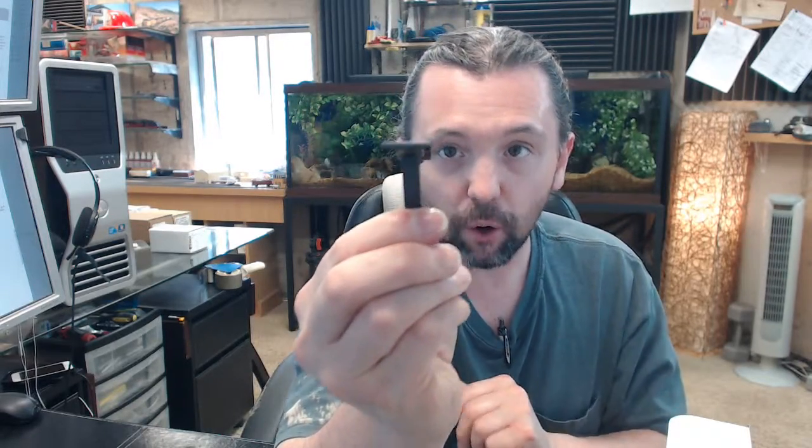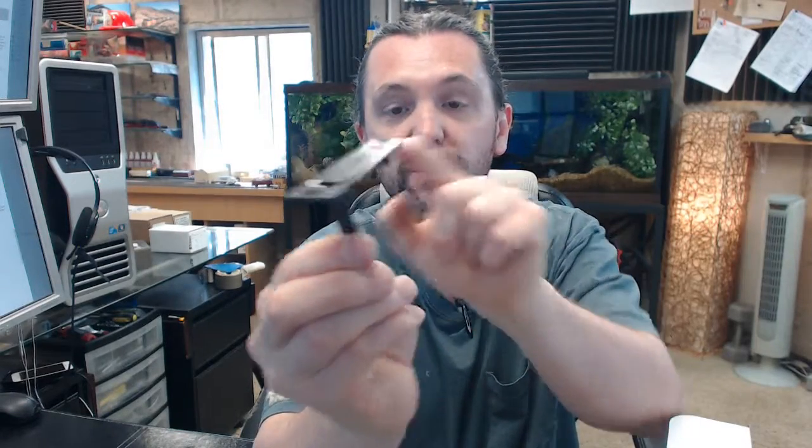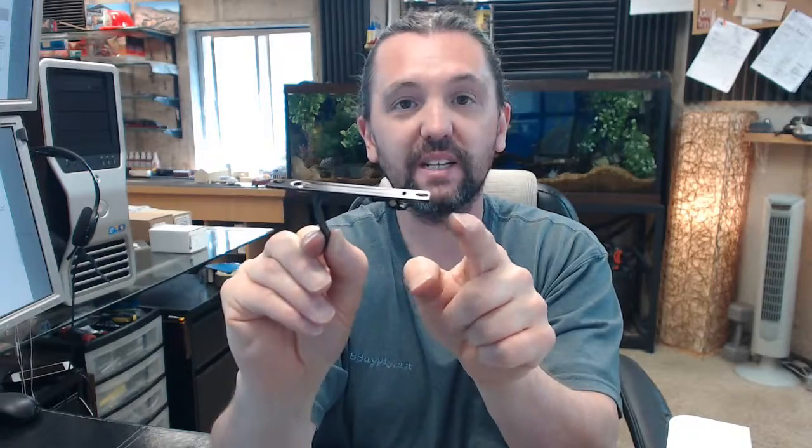Now, what I like about this Trimco item, and it's a feature on really most Trimco pieces of hardware, and you can't see it on the video, is that the edge of this material is not at zero degrees. The material is cut ever so slightly in, so that when you mortise for the plate itself and push it down into the area, because the outside edges are like this, it will compress into your opening, making a very hairline margin between the hardware and the edge of the door, giving it a really nice fit and finish. If those edges were square, it'd be okay too, but you get a better compressed fit when you've got a beveled edge to the plate.